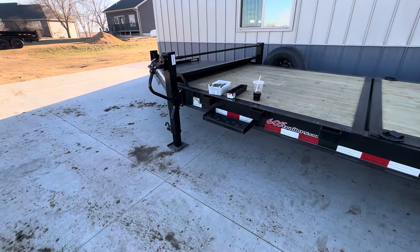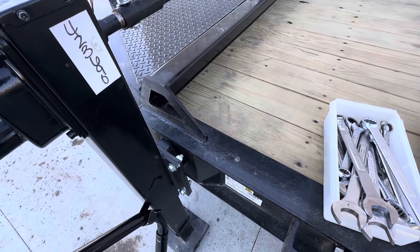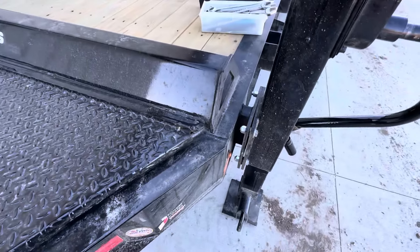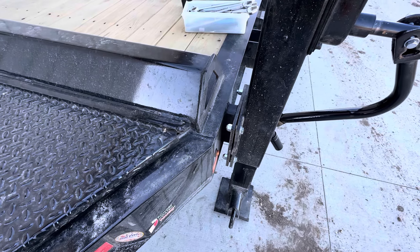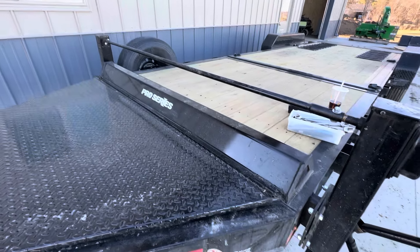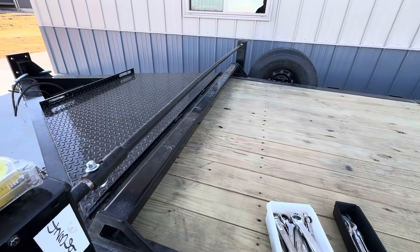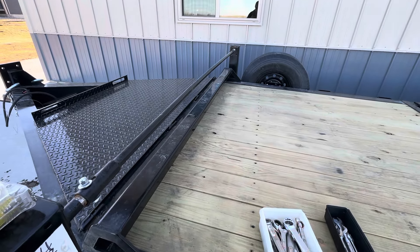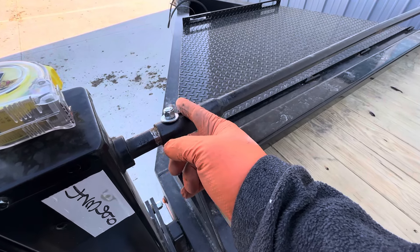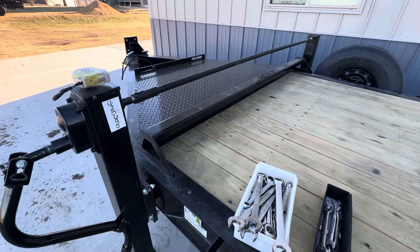That's just something I'd point out and different ways you can handle situations. You could get mad about it and go yell at somebody, but really what's the fix? They'd have to gouge that plate off and re-weld it, which means the powder coat is now toast. Then you've got to repaint or re-powder coat it, which you won't be able to match, so now you've got a spot that's potentially going to rust. I think this is the easiest fix. I'll eventually get that bar straightened out — once I get my press set up I'll get it done. I tried to put a slight bow in it with the tractor forks thinking it was binding up because it was too long, but it wasn't — that was my fault for not digging deeper before I did that. Anyway, thanks for watching.